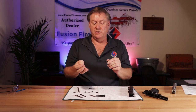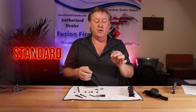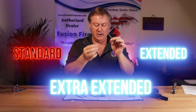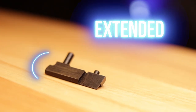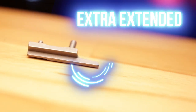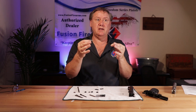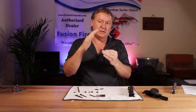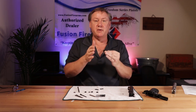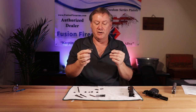The other thing to look at is the nose. You have standard military — ground right back — which very few people even want. Most people want an extended or an extra extended. The difference is just the length of the tip. The extra extended — generally you will never use it as-is; you'll grind it back to where you like it. A lot of people like the extra material because they want to do the fitting themselves: grind it back, change the angle slightly, test fire, see if it's ejecting the way they like, then come back and adjust the angle a little more.